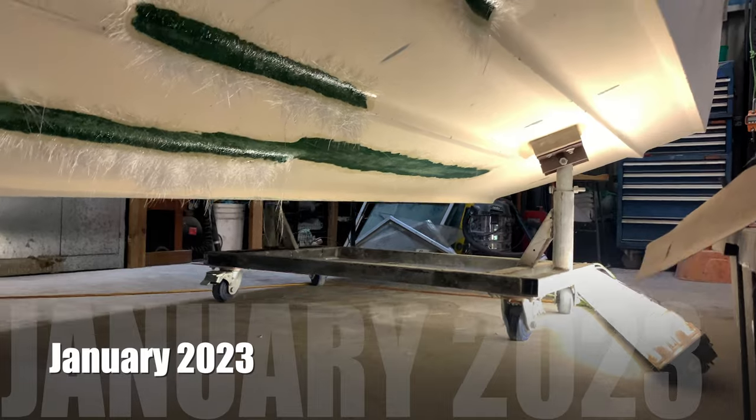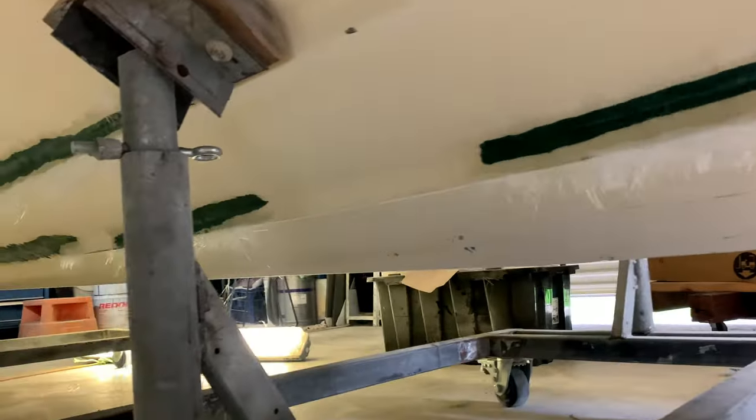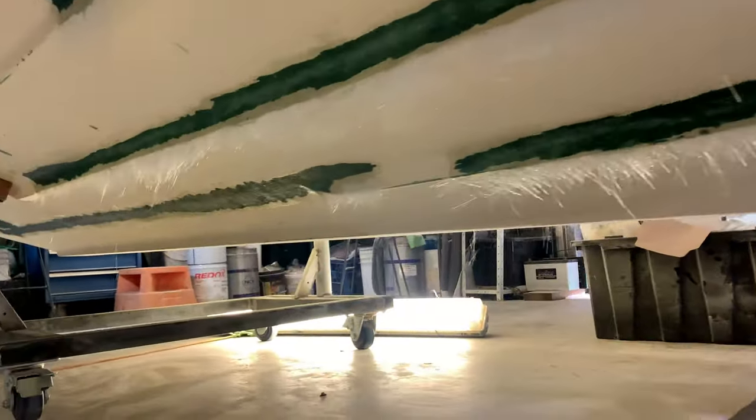From there I moved on to the gel coat prep. I planned to tackle from basically the gunwale down. Any major cracks that I could find, I ground them out and re-glassed them — there were quite a few along the strakes. There was a bit of damage up on the nose, fair bit of trailer damage and stuff like that. I made sure I ground all that right out and re-added glass. I wanted to use very minimal fairing compound — if there was any fairing I wanted it to be super thin with a nice strong glass surface underneath. A little bit of grinding and glassing on the bottom of the boat was pretty easy just laying on my back and side doing it.